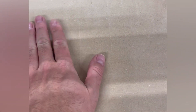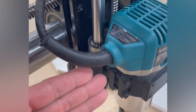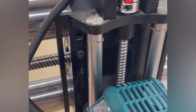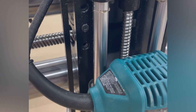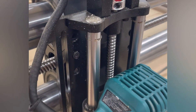I was out here tramming my CNC last night. For those who don't know, tramming — you see all these little ridges — basically means the CNC head is tilted forward or backwards just a bit, so it's not cutting perfectly parallel. Tramming involves shimming it out on the bottom or top to get it cutting flat. Apparently I'm a little stronger than I thought — I torqued the screws too much, and when I went to pull them out they stripped. So now I'm using a screw extractor to get those out and replace them with new ones.